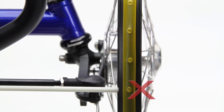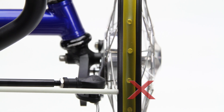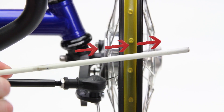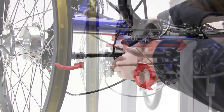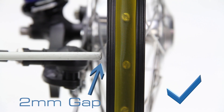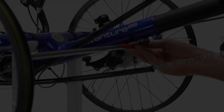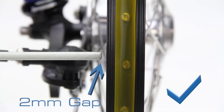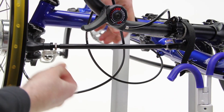Return to the rear of the wheels and check again. If it still does not fit, repeat the process. If the gap is too large, you need to lengthen the tracking tool and adjust the front of the wheels out to fit the tool. Then check to see if the gap at the back has now closed to 2mm. If the gap is still too large, repeat the process. Once you have the tracking tool touching both rims at the front and have a 2mm gap at the back, you can lock off the second track rod just as you did the first.